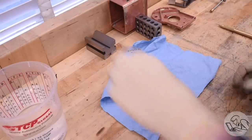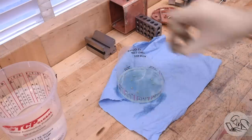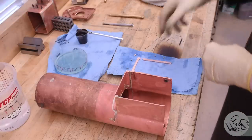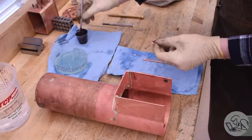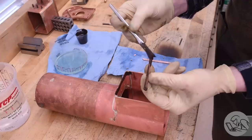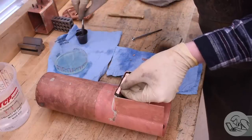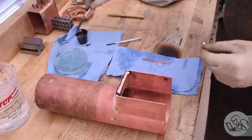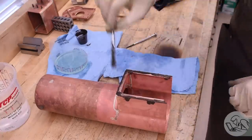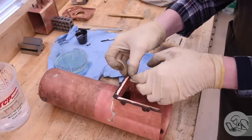I decanted a little pickling acid into a tray so I can pickle all the little screws — some of these are custom lengths to go in exactly the right place on the foundation ring, so I need to keep them all in order. I also have to pickle that little filler shim that I made. All the big parts just get dumped in the big pickle bath as usual. Now with everything pickled, rinsed, and dry, I can get everything fluxed and get ready to solder everything together. As with every other joint on the boiler, everything gets fluxed — including the screws and all the little shims. There's absolutely no reason to be shy about flux. If you build a few boilers you quickly learn that it's vastly more important to get joints that are mechanically sound the first time than to get joints that look pretty. The boiler is getting painted anyway, and if you're worried about what the joints look like, you are going to fail a pressure test.